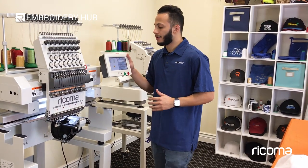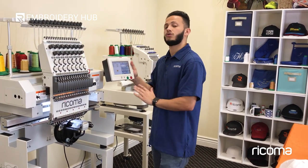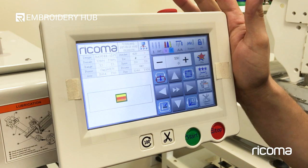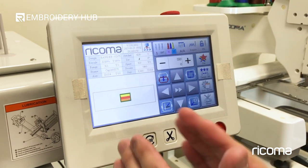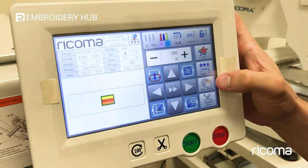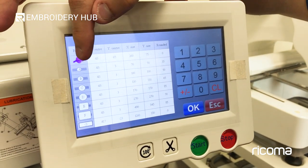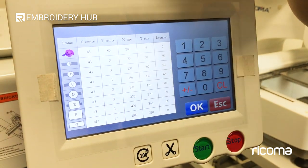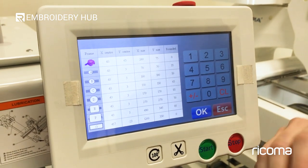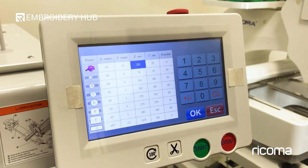When it comes to embroidering on the sides of a cap using the cap driver itself, you're actually going to have to change a few parameters inside the control panel itself. What's going to have to be configured in order to complete this process is that we're actually going to have to extend the x-axis of the cap device itself. The way that's done is you're going to go into E and B parameters, and then from here, we're going to select frame. On frame, for the one that's the cap, we're actually going to have to extend the x-size. By default, it's set to 260, which is generally just covering the front area of a cap. But since we're going to get to the side, we're going to want to enlarge this number. 350 is an okay number to get to the side of it, and then we just hit okay.